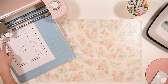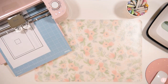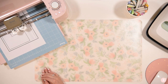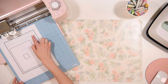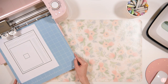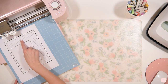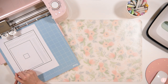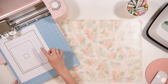Now what it's doing is it's going through and cutting on the top lines where the numbers are. Now it's going through on the side and cutting on each of those lines where the alphabet is — going down the side now. What it did is it just performed the calibration cut by going through and cutting on all of the lines on top and down the side. Now it's going to ask us what line is on the center the most. You're going to look at each of the cuts and see where — on which number and on which letter — it has cut exactly through the line. I'm looking and it looks like three on top, and on the side it looks like I. So three and I.